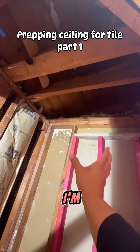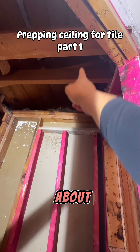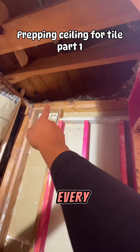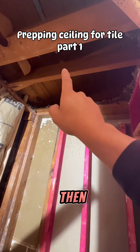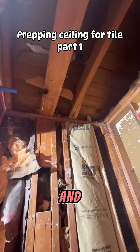So we have 42 by 42. I'm going to run 36 from this corner to about here and then I'm going to put a rip right here. So I'm going to mark every one, two, three feet and then at the end, and then I'm going to mark it on every stud. We're going to add a shim and then we're going to hang our board.